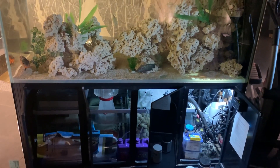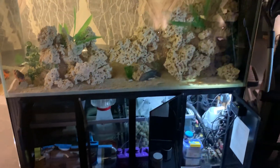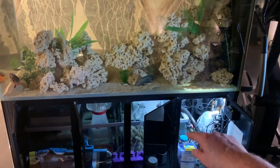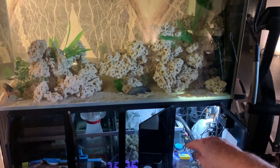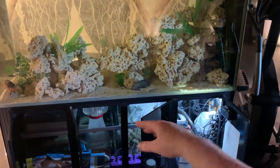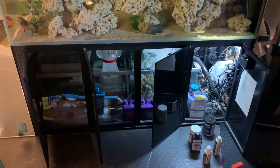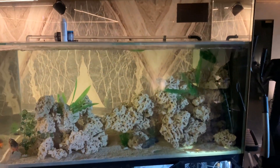Mark it as your 'on level', because once you've set that level, if you have the water running and you fill it up above the on level, then turn the pump off and the water goes back down to the bottom, it can actually overflow — which isn't great. So if you've got a sump, it's really important you understand it.